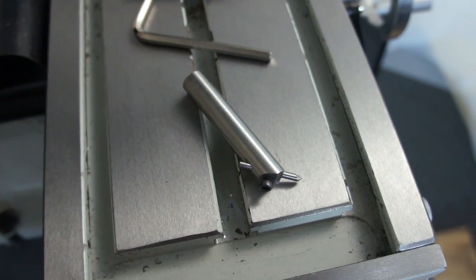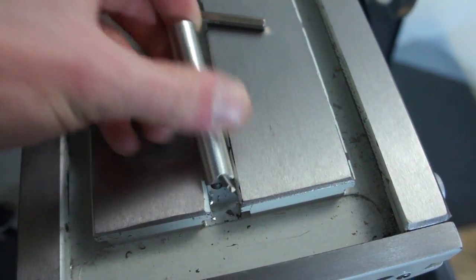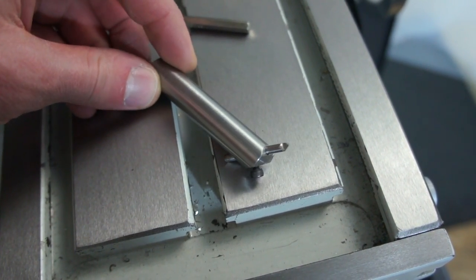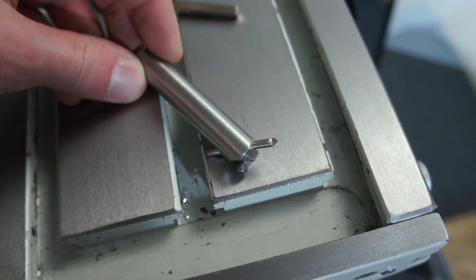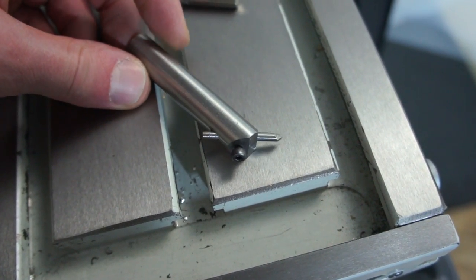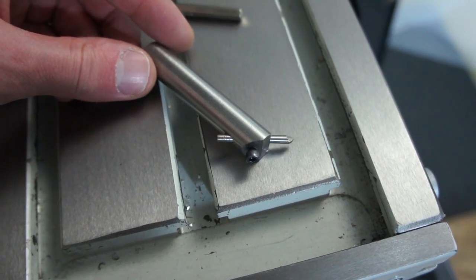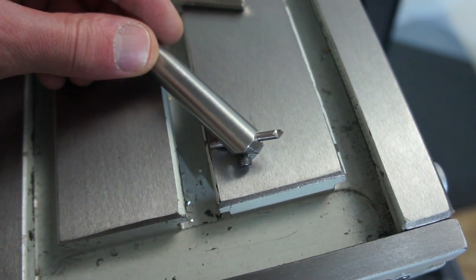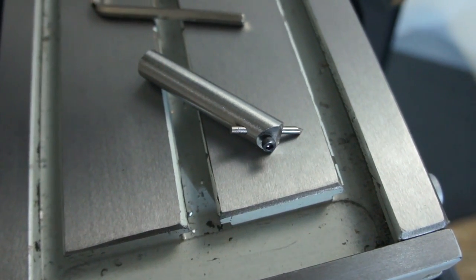And I haven't made a ton of tools with this machine yet, but one of the ones I made that came in super handy is this little cutter that I made, kind of an adjustable bore cutter, and it just has a high-speed steel drill bit shank that I sharpened to a geometry that would work, and then a cross-drilled little set screw in the back, and that lets me adjust the diameter of a hole, and I use it to clean up and just take a few thou off a hole that was CNC cut and that wasn't perfectly round, and I required it to be, you know, dead on. So it worked perfectly for that purpose, and it was actually a pretty quick build. I'll show you another thing I built with it.